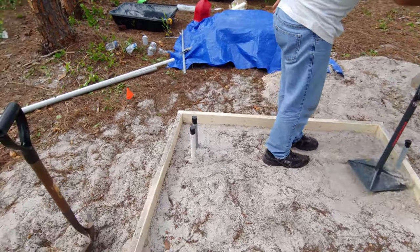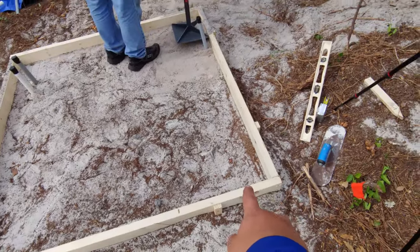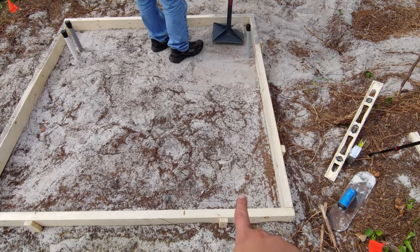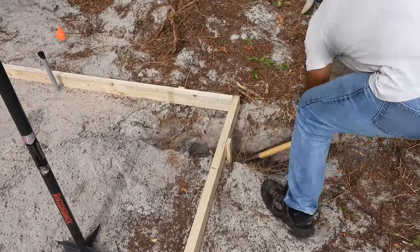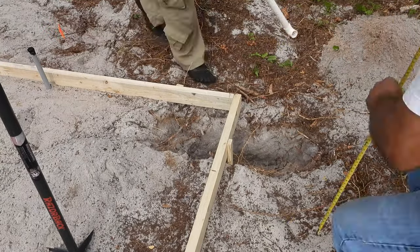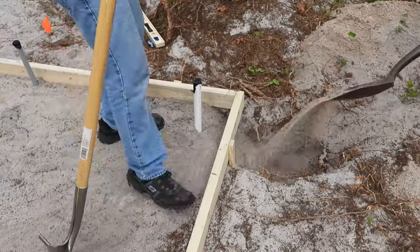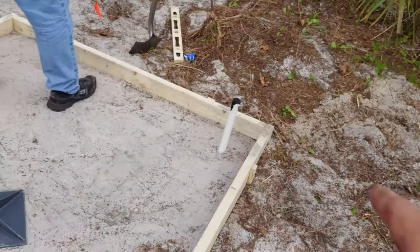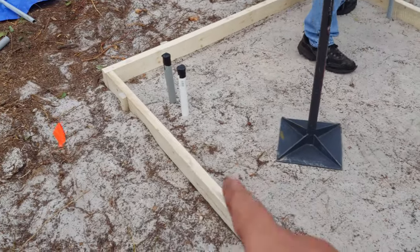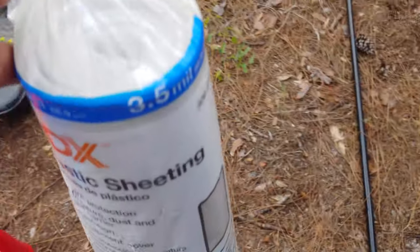All right, this is pretty intense stuff here, but we've got that side complete, the electrical on this side complete, and now we just have to get our PVC 1-inch water pipe on this corner finished up. Okay, after much shoveling, guys, pipe, conduit over there, two here, pipes are done. Now, moisture barrier, visqueen goes next. Here it is, plastic sheeting.